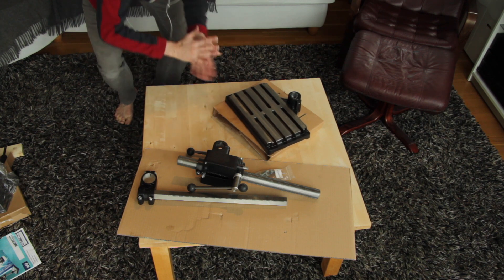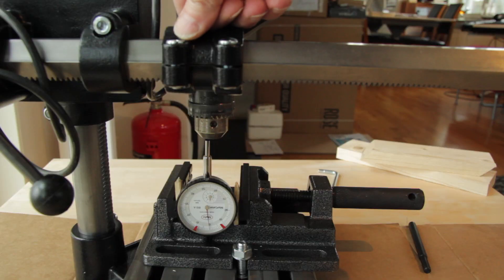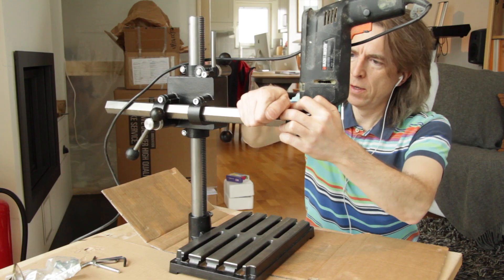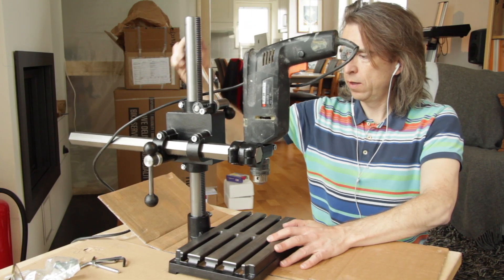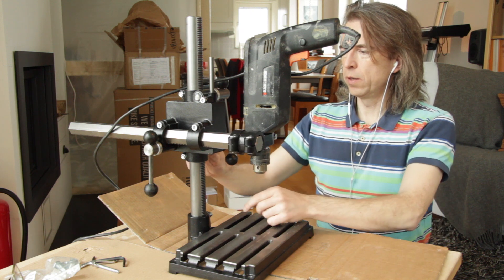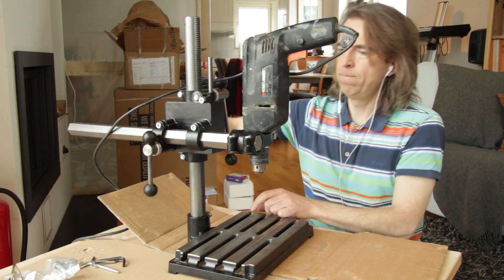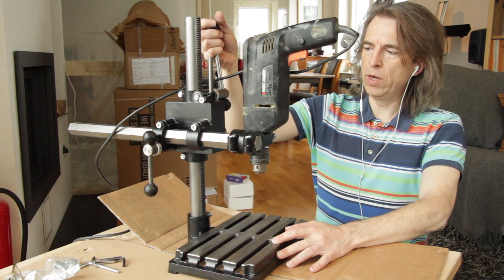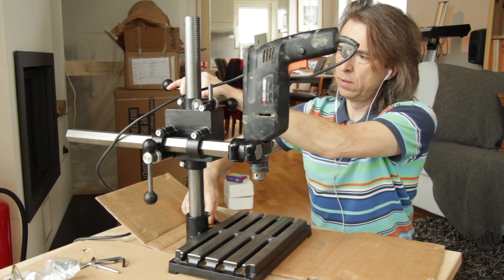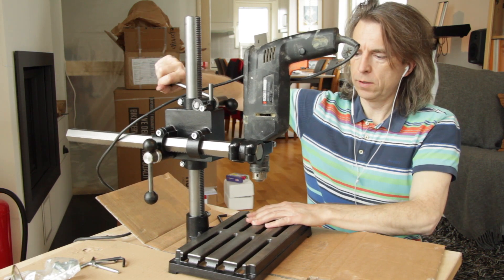Let's put this together. There you have it — it's adjustable, it's very, very sturdy. It's very low. I put a bit of pressure here, and then you can set the main level here. You need to buy an Allen key because you fasten everything here with an Allen key. So I fasten it here on the back — now you have the drill press function engaged. You can set the depth stop like that, then fasten it and now it's stopped there.